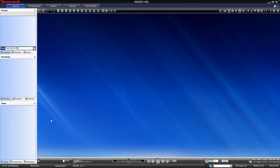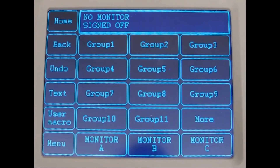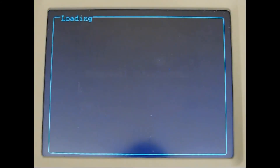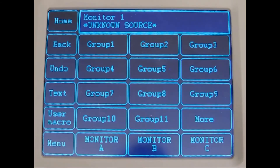Once it's loaded, you'll want to confirm here in the bottom status bar that you see the name of the monitor we set up earlier, along with the monitor number we assigned it. Reboot the joystick by power cycling, and you should see the monitor name and camera name appear once it connects. Once your joystick connects, you should be able to control the PTZ functions, pull up cameras, etc., using the keypad options to the right of your keyboard.